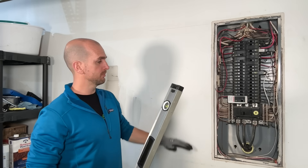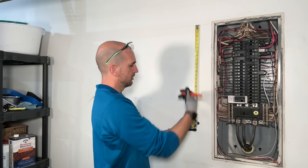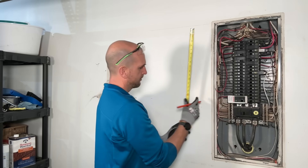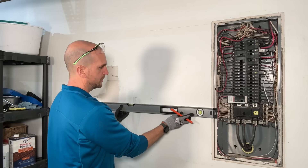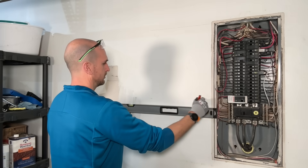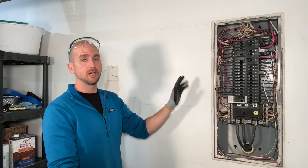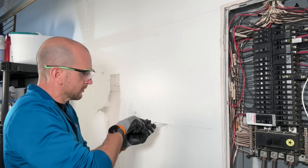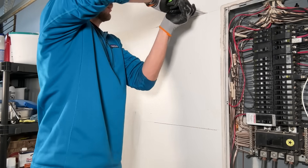The bottoms will be a little different because I only have 24 spaces on this sub panel, and the box is going to be 21 inches in overall length, so I'll reference that top line and mark off 21 inches. Then I'll bring out my four-foot level, reference that 21-inch line, make sure my bubble is level, and reference the top and bottom lines. I'll follow the studs down with my jab saw to open up the space for a dry fit of our sub panel.